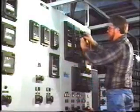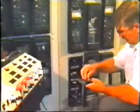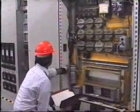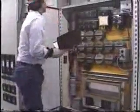When testing relays, we would always prefer to de-energize the equipment and, if possible, remove the relay from its casing. However, when this is not possible, make the test block connections — such as external shorts and open potential circuits — before inserting the test block into the relay case. If it is necessary to work on live circuits, be extremely careful to avoid contact with grounded objects, as your body may provide a path to ground. Stand on a rubber mat if possible.